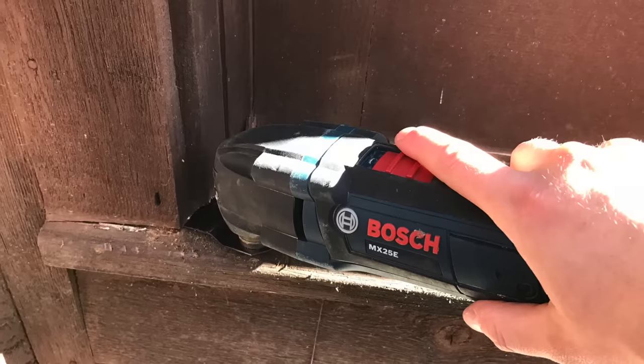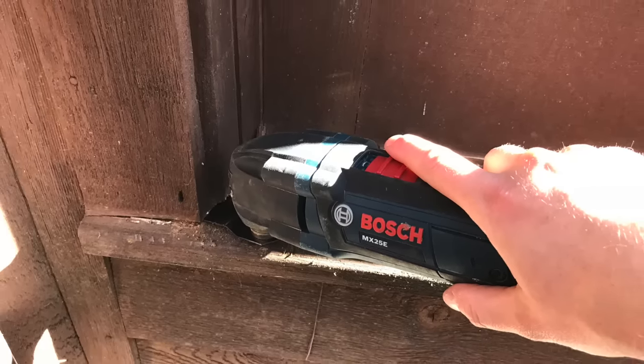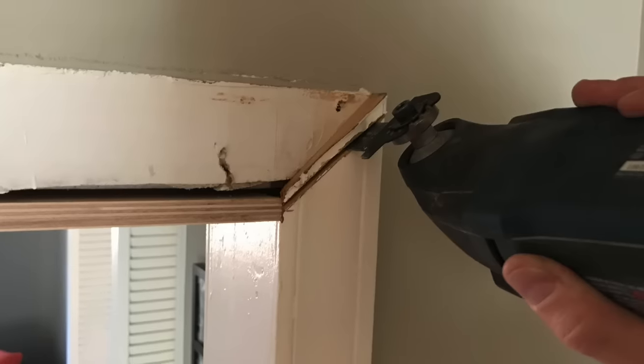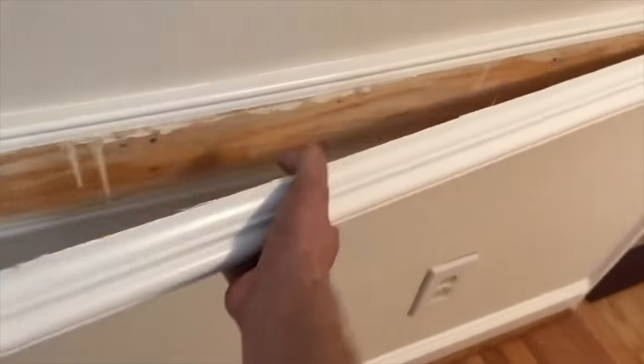More often than not, I've used it to notch trim. I can undercut jams and casings with it to give them a little more bottom clearance or room for sealant. I've cut out and replaced whole panels and picture trim, like you see here, and I even got to the point where I could carefully re-cut miters in place by hand with the multi-tool. That's the most miraculous thing about it — trim work.